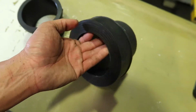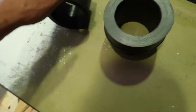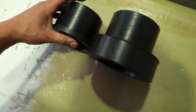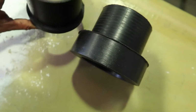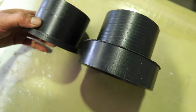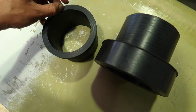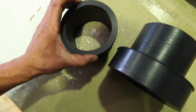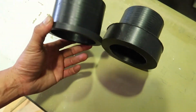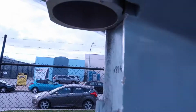That was the bearing original, and this is the bearing that will fit. So it had to be trimmed right up. It's a lean version of the bearing. The internal stayed the same, but it's just this big flange on the end. So that's brought down to 10mm thick now and 112.5 wide so that it fits. So we'll go have a look, see whether it fits.